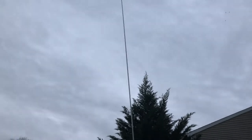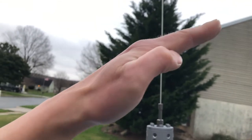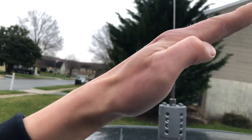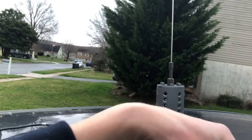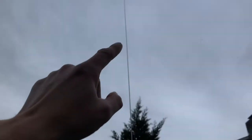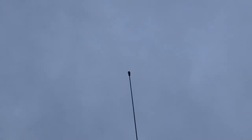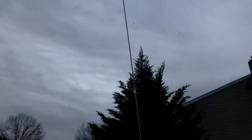Think about a vertical antenna — it's technically a dipole. One half is the antenna itself, the other half is the roof, which acts as the ground plane. When guys tilt their antennas on an angle, half the signal is going down to the ground in front of them and the other half is going up at an angle behind them. They're not going any further forward. The signal comes out of the whole length of the antenna, not just the tip. Keep them vertical, guys.